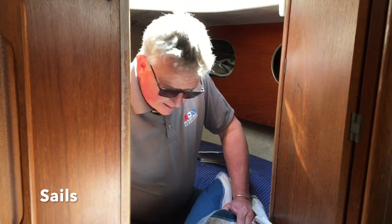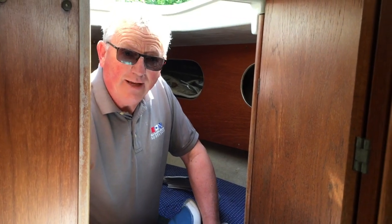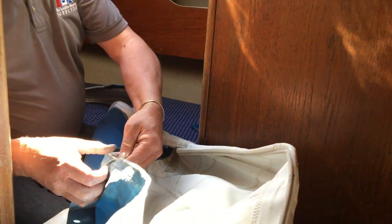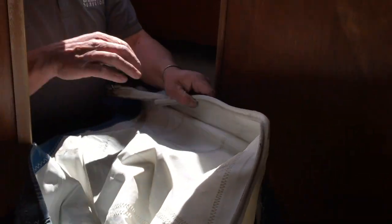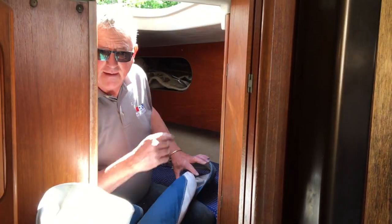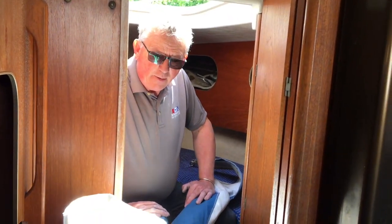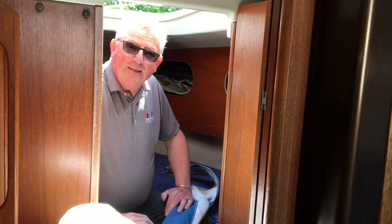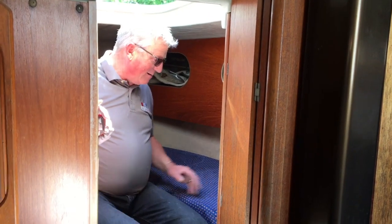With sails, the surveyor can only see so much. To see how good a sail is, you really need to take the boat sailing. But straight away you can see this UV strip here has had its day - it's completely worn away and faded and starting to break down. The sail itself doesn't feel too bad; it's still got that nice noise to it when you give it a scrape with your nails. But the main down there is definitely a lot older than the Genoa. I always say to people - at the end of the season, take them to the sailmaker. Get them looked at before they get all wet and horrible.